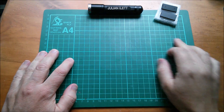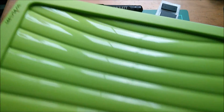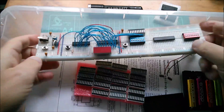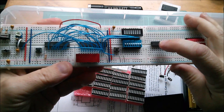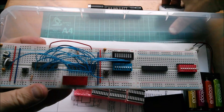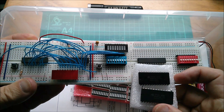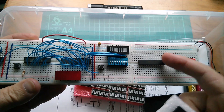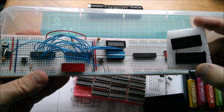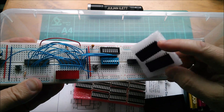These are for the 8-bit computer project, so let's look at the 8-bit computer project box. That's the basic 8-bit computer as it stands at the moment. I'm using these skinny DIP RAMs — same number of pins but in a skinny package, I think 28 pins. It's just a neater package. I'm sure these 6116s will do exactly the same job, but I quite like the skinny DIP package so I can't guarantee I'll actually use these.